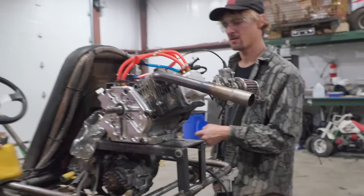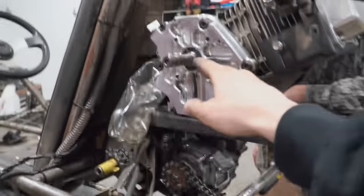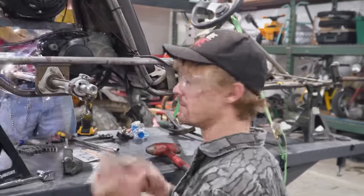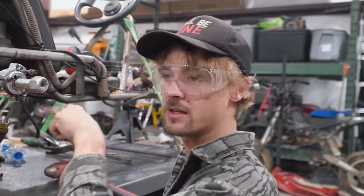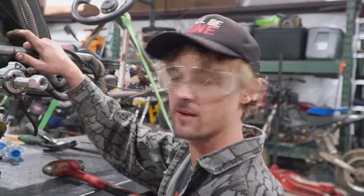What's up everybody, today on Cars and Cameras we should be taking our Tillotson 225 six-speed swapped go-kart for its first ride. This is a bored-out stroker, big-valve 225cc engine that makes about 25 horsepower, chain-linked with a Yamaha Blaster transmission from a blown-up Yamaha Blaster engine. So we had a mishap last time — the flywheel flew off. The nut got loose when we were spinning the transmission over, it sheared the key and popped off, and jumped the chain everywhere.